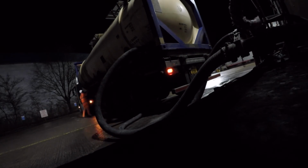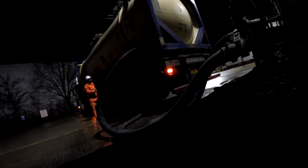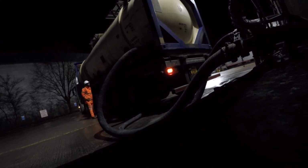And you're hearing the whoosh again there. So compartment 1's empty, close the valve, open up aeration bed number 2, close aeration bed number 1, because whilst you've unloaded the back and the front compartment, some more of the powder has jumped into the middle section, so just a little bit more to do from the middle compartment.